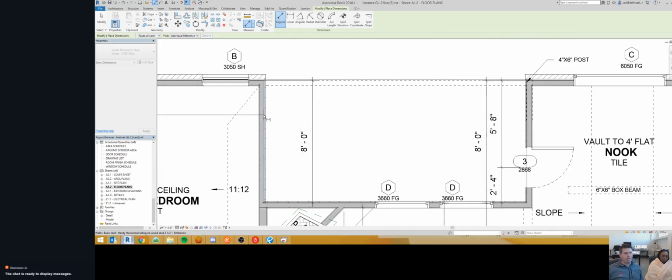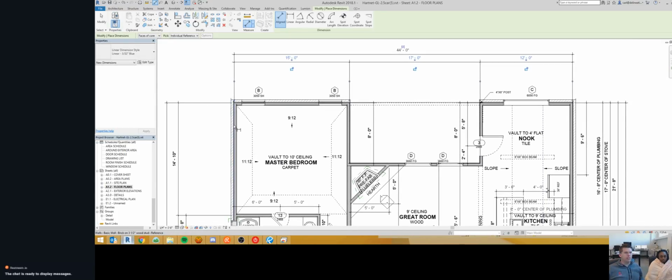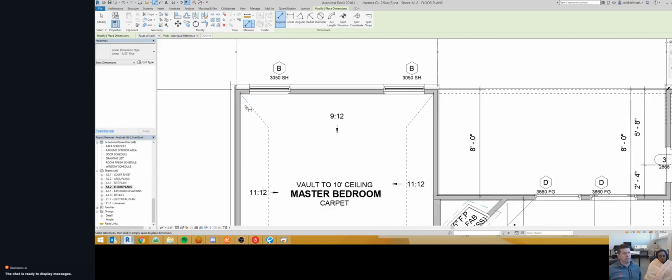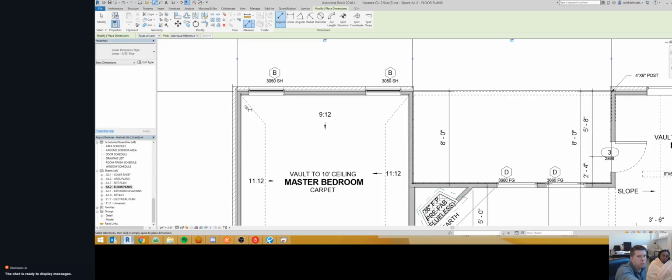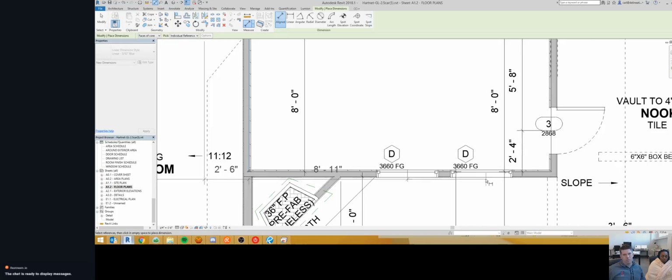So for the exterior walls, I come in and give them where the building goes in and out like that. Just like that. And then the next one is going to be windows and interior walls where they meet the exterior wall. And also, sometimes if there's a bunch of little pieces right here, like if I do a bump out right here, I'll maybe dimension that separately if it gets too complicated. But for the majority of times I have 3 dimension lines: overall, segments, and then details, where I come in and dimension all the little pieces.